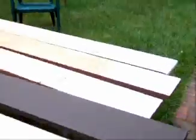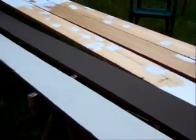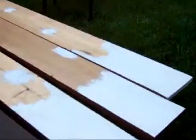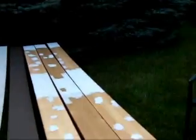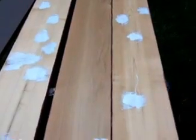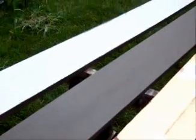Here's some trim. These first two are artificial trim, which is what I've put mostly on this house after I took off the cedar. It's always a good idea to paint the backs of any natural board that you put on, so I went ahead and primed the most vulnerable areas. I went with cedar around my doors just because I wanted it to look pretty, but otherwise I gave up on cedar long term and I'm going with Miratec artificial trim, which has a 30-year warranty against rotting and warping.